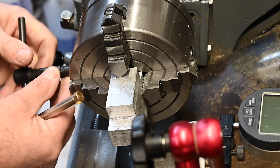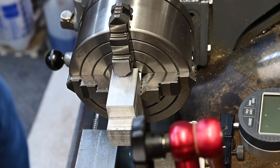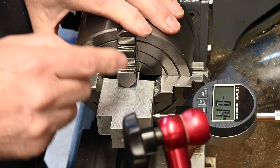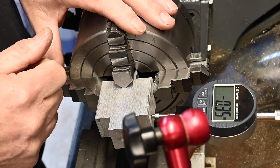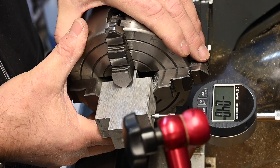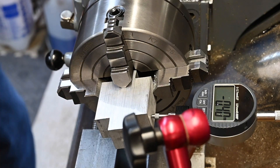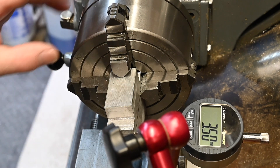That's gone too much on that one. Now I can get the indicator on — so that's zero. What you have to do is turn the jaws a little bit to find the highest reading, which is the furthest extent of the piece. That's reading minus 40, which means it's gone in that direction by 40, so I'm going to adjust it 20 the other way. I've now got it set up within a tenth of a millimeter either way, which will be fine for this.